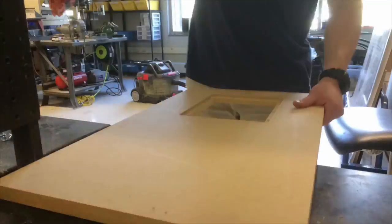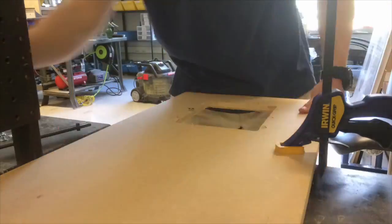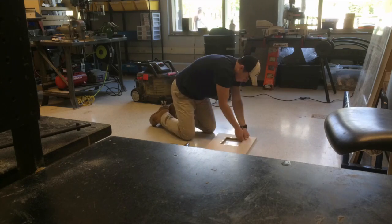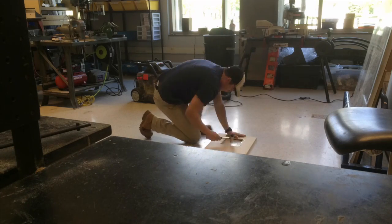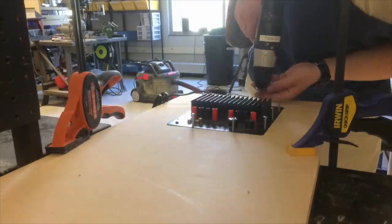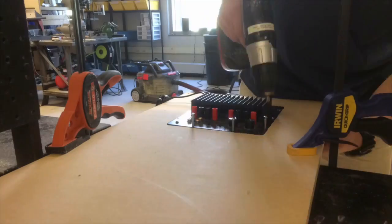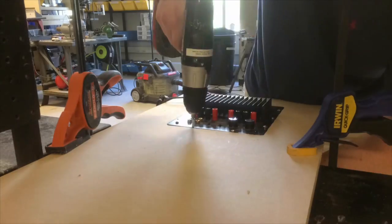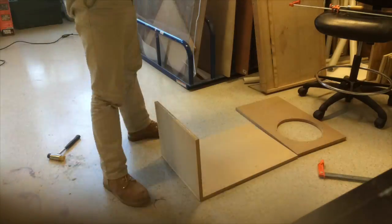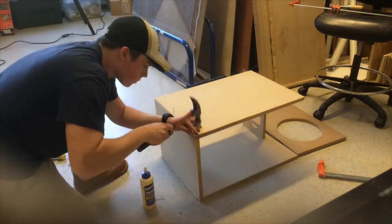An important aspect of speaker cabinets is that you want them to be as sealed as possible. My design still allows access to them through the back by removing the amp, or the front by removing the subwoofer. I accomplished this by using T-nuts. The T-nut is attached to the inside of your cabinet prior to putting in the screw. The screw will then go through the wood, through the hole, and into the T-nut. I also made sure to use wood glue in all of the major crevices to provide an even better seal.